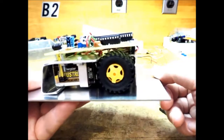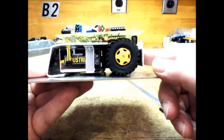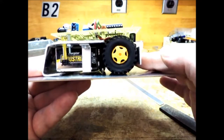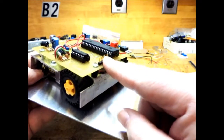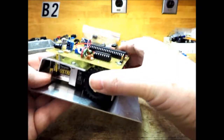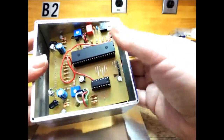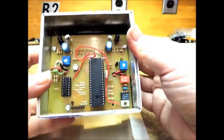We need to be careful of that. This little guy has to fit in the box when it's done. It took me a couple of bends to get the back end so that it would be small enough to fit in the box. I also had to change my connector on the back and bend the pins up rather than having them stick out, otherwise it won't fit in the box either. This SumoBot has to fit in the SumoBot box — it's a fairly snug fit. It's competition ready, in a 10cm by 10cm box.